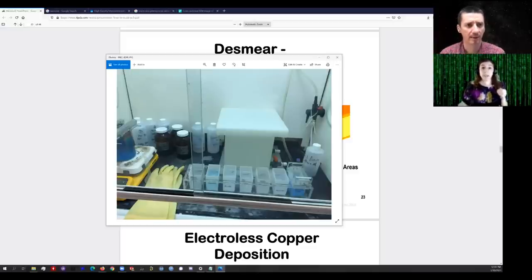The tin will not adhere to the copper surface in any appreciable quantity — it will be basically only inside of the vias. Silver, however, has a higher redox potential than copper too, so silver will still adhere to the copper, which is why the whole board turns gray quite quickly. But the holes in particular go from the fiberglass yellow-brown color to gray, because there's silver depositing.